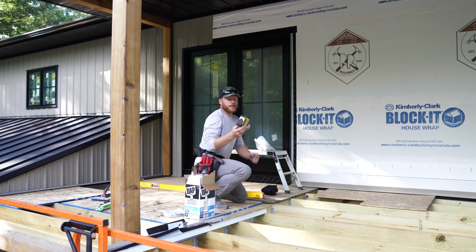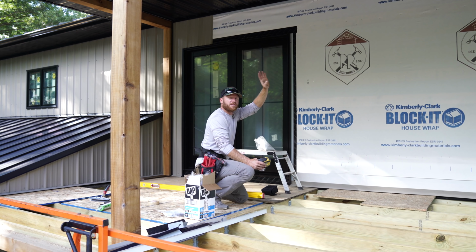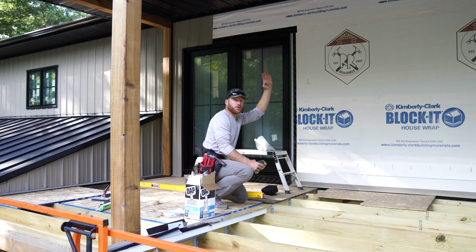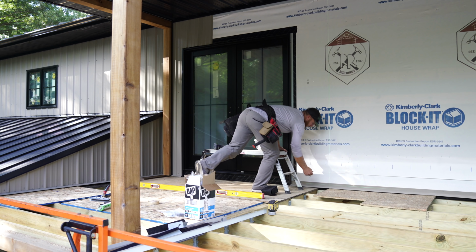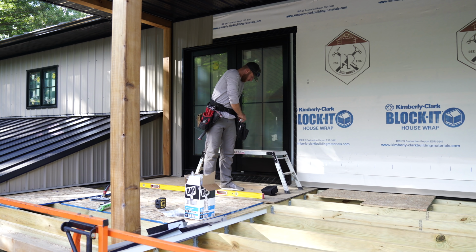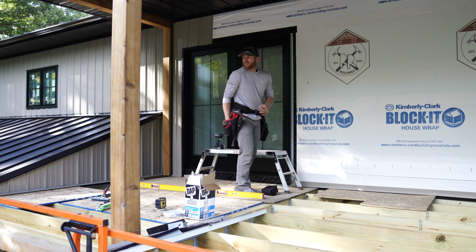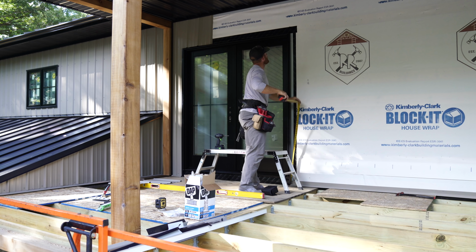What I'm gonna do is just use this line laser, plumb it up to one of my ceiling ribs, exactly where the center of the good rib is, so that I can make sure down here at the bottom, I'm perfectly plumb, and then I can lay out my measurements. All right, so that's center of rib. Greg, can you give me a dimension on center of rib to edge of panel? I just want to know where I lay out my exact mark. What'd you say? 37 and 3/16. Okay. All right, height on the next one will be the same, 83 and a half.